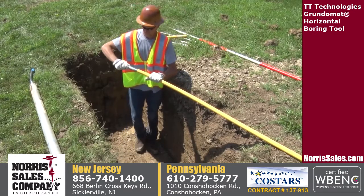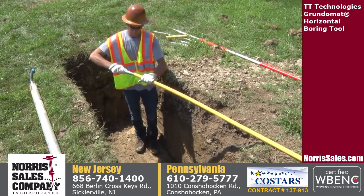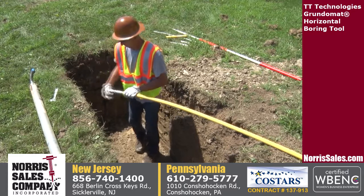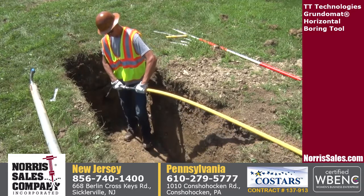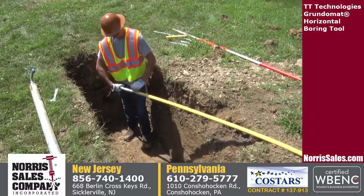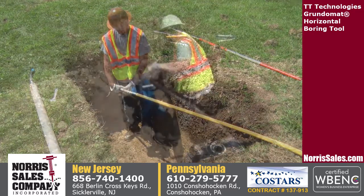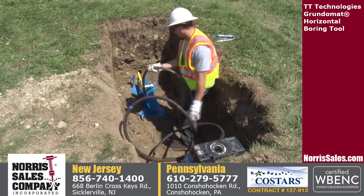Using the air hose to facilitate installation of the new pipe is a common pipe installation method. Attach a threaded pipe pulling adapter to the product pipe, then connect it to the air hose. Pull the new pipe in place while pulling out the air hose.